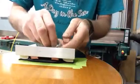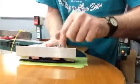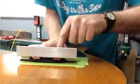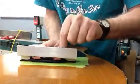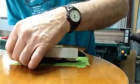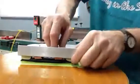Now you probably know enough about guitar construction to know that there's a bridge plate right underneath this center section of bridge that I'm tightening against with the assistance of that aluminum caul to get some glue on the end of that screw, so that's why it's not just spinning down. So out at the ends, this is why I think that a vacuum bag would be nice. Out at the ends of the bridge here, you don't get the kind of pressure. You kind of have to predetermine how well that's going to go down, and that's what I've done with these different size cauls, little clamping blocks.